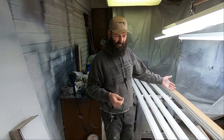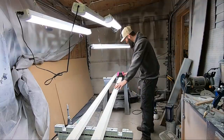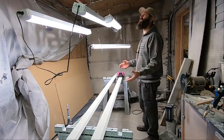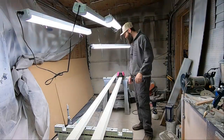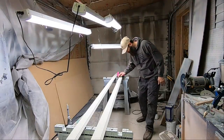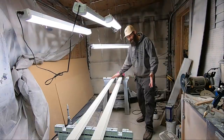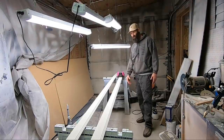You may notice that I have a lot of lights over my paint area. I can raise and lower these as I need to. The reason lights are very important is as you're going along, you can easily see how thick the paint is and how it's wetting out. It really helps getting a good, consistent coat over whatever you're painting — a door, trim, or cabinet.